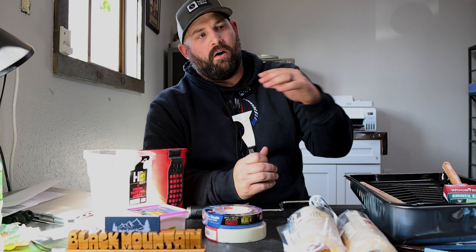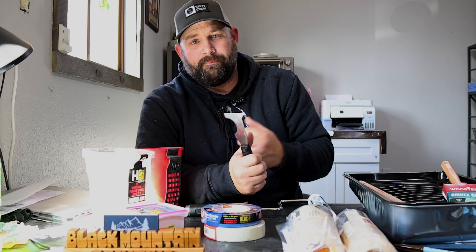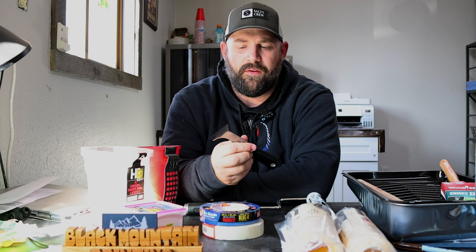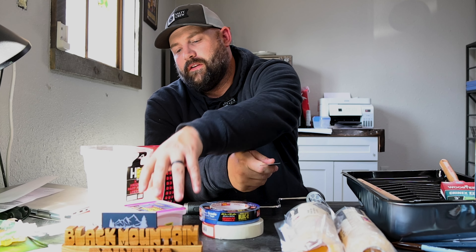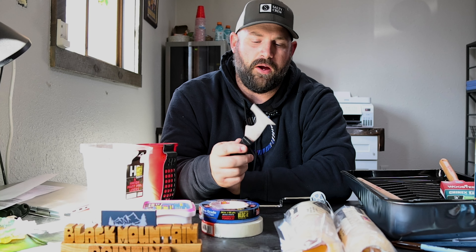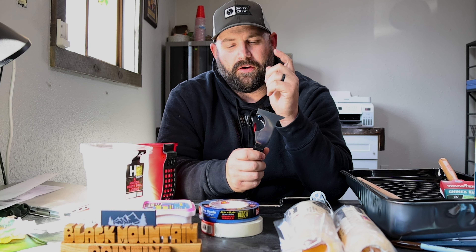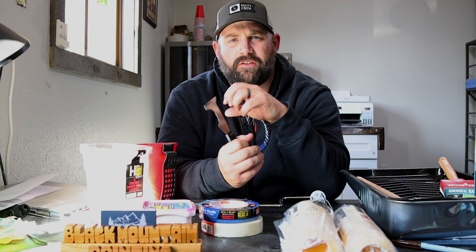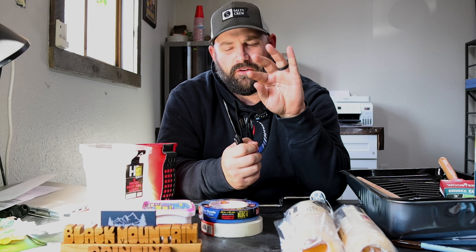The five-in-one is also great for outlet covers — you want to take off all your outlet covers before you paint the wall, and this tool means you don't have to carry a screwdriver. It also works as a putty knife for nail holes or anything like that. Just put it on there, scrape it, and make sure you've got a little bit of extra putty to build up so when it dries it doesn't seep into the hole and leave a divot.